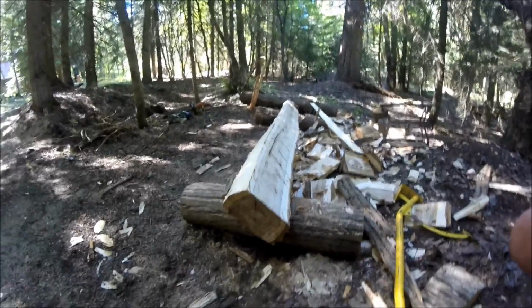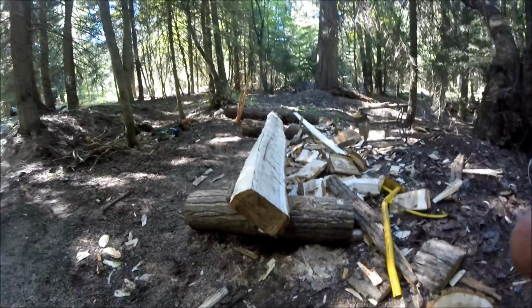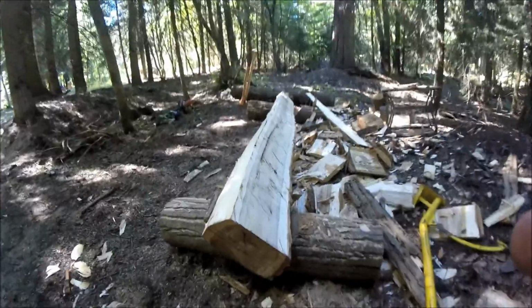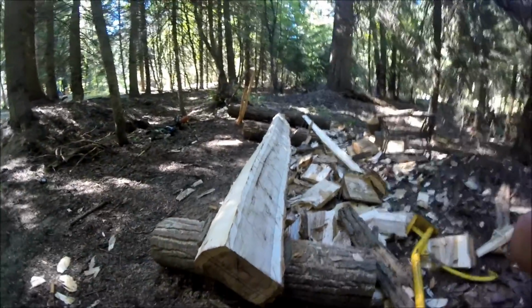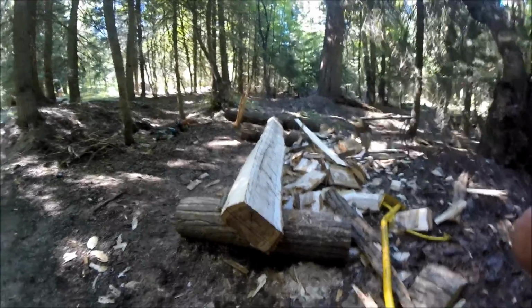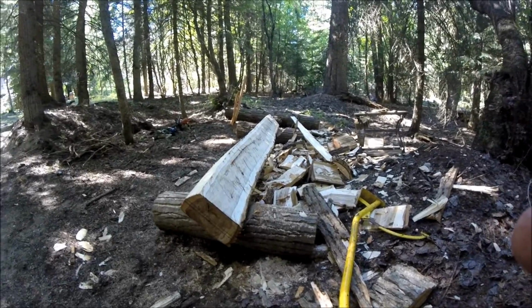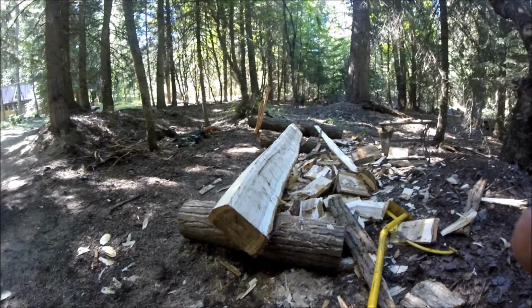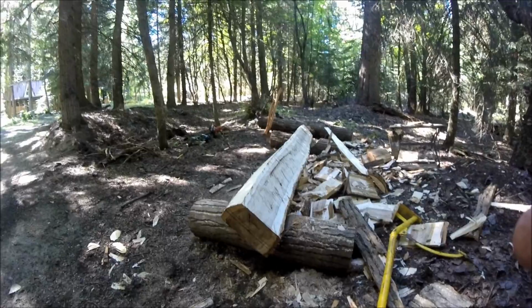Just a couple of things I was talking about. When you're first chopping those blocks off, the axe is at a right angle to your body. By the time you're trying to hew the diagonal, then the axe is trailing so you can chop down. I think the whole idea with hewing, and the reason the axes are so big, is the weight of the axe makes it so you're doing less work. So you're just kind of dropping the axe and letting it cut. And on green wood, it's fun to hew.